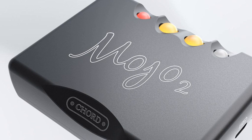Yeah, the design brief for the project was that it must be compatible with Poly. What we didn't want to do was to have all those thousands of users of Poly be upset that they couldn't upgrade. So it needed to work with Poly. The original design brief was that there would be 2 USB-C ports, one for the charging and one for the data. But it was just such a squeeze. The trouble with USB-C connectors is they're physically very long. And the one that I was going to put in for the charging port conflicted with the optical, which meant dropping the optical, and I wasn't prepared to do that. So we're just left with 1 USB-C.